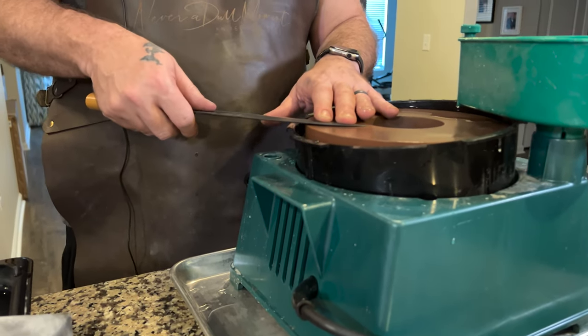The knife is kind of laying down but the pressure is minute — I'm literally letting the blade sit. The 800-grit is aggressive, it doesn't need my help pushing. My fingers are just there to make sure the angle is correct. I'm always checking to make sure that blade is down. A lot of knives are thicker at the heel, which makes it harder to do at the bottom because of the handle. My stone holder lets me get the stone to kind of stick out so the handle gets out of the way.